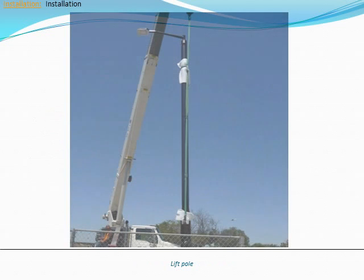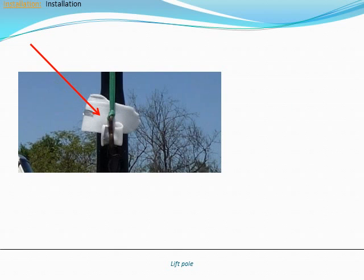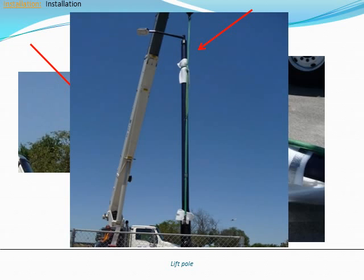Make sure you have a certified lifting hook, a nylon strap, and an Inovus security bit to open the door on the pole. Connect the hook to the wide nylon strap, then open the door on the pole and connect the hook to the top of the door's opening. Make sure the hook does not interfere with the internal equipment. Use some of the packaging foam to keep the hook from scratching the pole during lifting. Take the wide nylon strap and tie a half hitch around the pole approximately three to five feet from the top. Make sure that there are no knots resting against the pole, as the pressure may dent the solar collector while lifting.